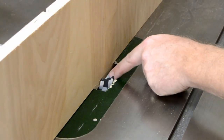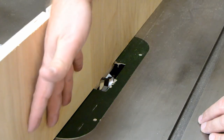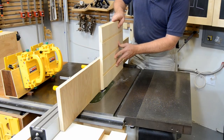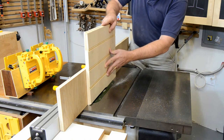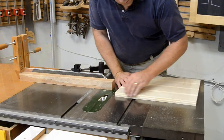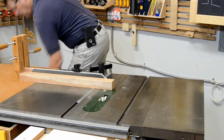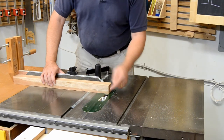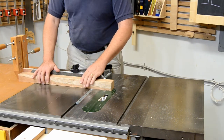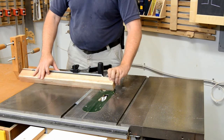Here I've got an OG profile molding knife in the molding head cutter. I've got a tall fence and I can mold this profile into a panel by running across it edge on, which is why I have the tall fence here. This comes out nice, but it's not terribly impressive — we can do that on the router table pretty easily. But if I want to put that same profile on the end wrapping around the end of a post, that's a little bit more difficult to do at the router table. So here I've got the same setup; I've reversed my miter gauge, put a stop on the end, and now we'll be able to do the four sides of this part using the table saw.